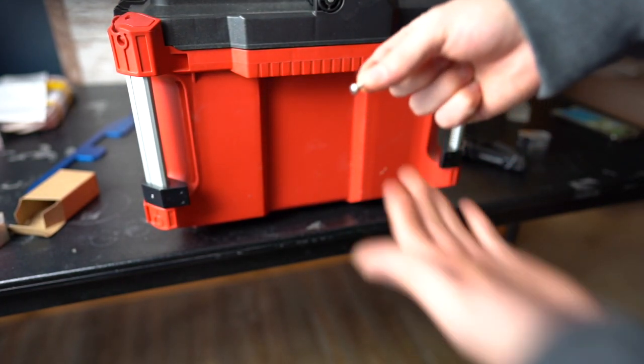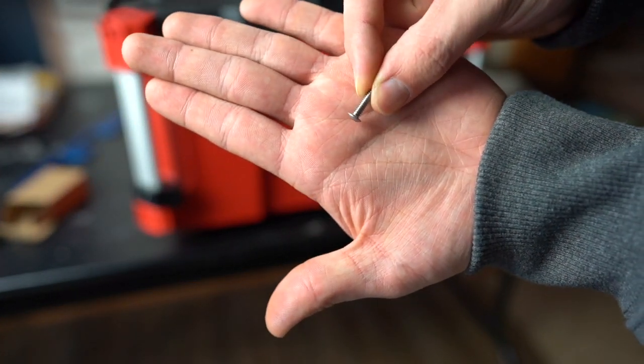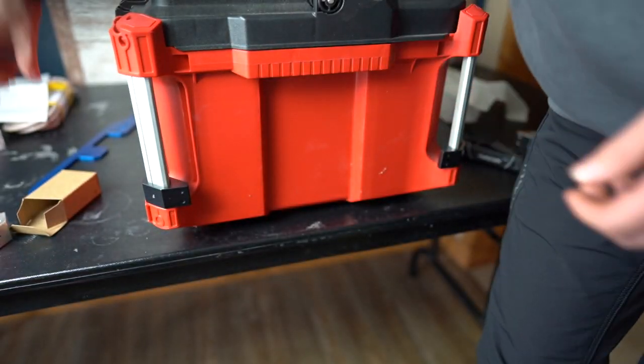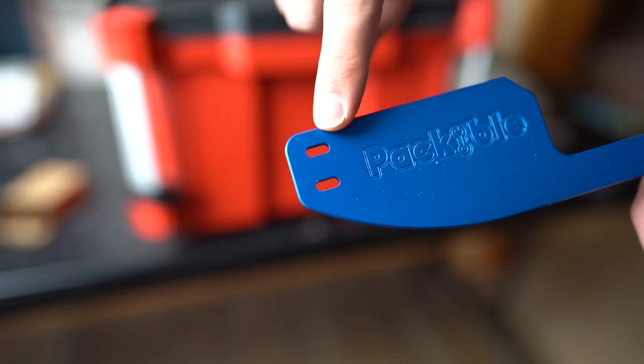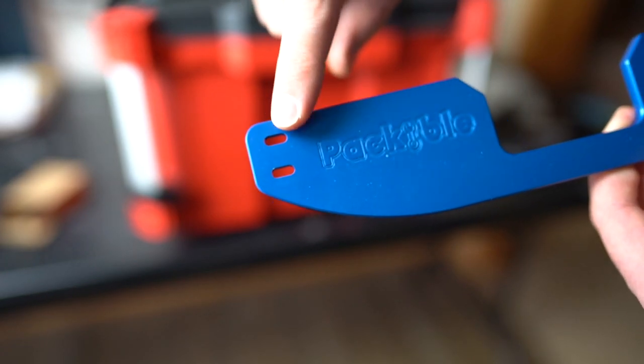All right, and then next step, you're going to want to take the 4 pan head screws that you have here. Get that to focus up for you. The pan head screws here, you can take the 4 of those. We're going to grab the bracket, mount it flush in place. These are slotted, which helps with adjusting left to right. It gives a little bit of slop.